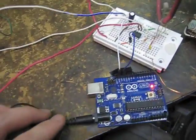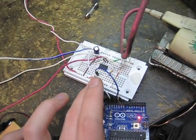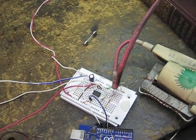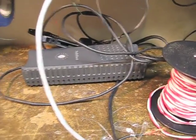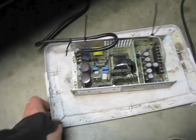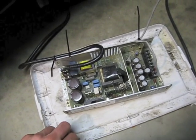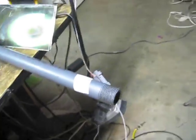I have a separate little battery for my Arduino but it shares a ground with the main power, which is a 12 volt power supply. I started off using this little Radio Shack power supply — 12 volts — but not really enough amps to get those sparks, so I'm using this power supply instead. That's a 12 volt supply and it gets the job done. I also have a 5 amp fuse just to protect the circuit and the transistor because they are not cheap.